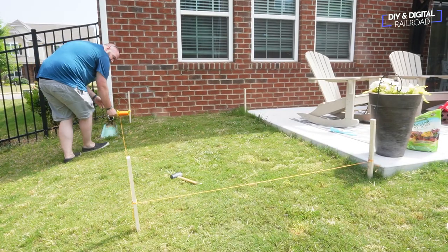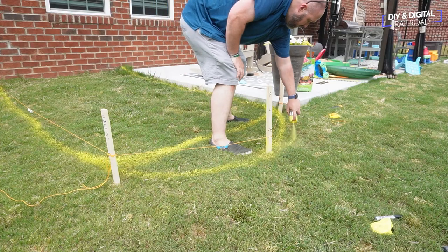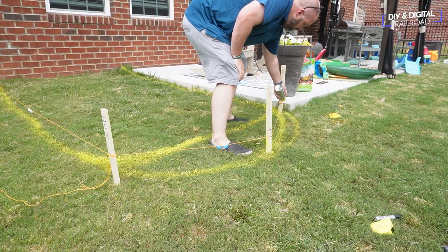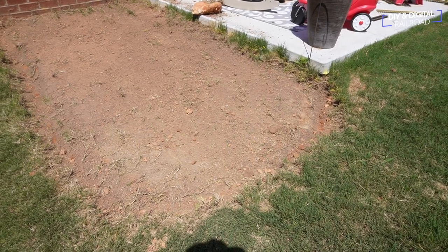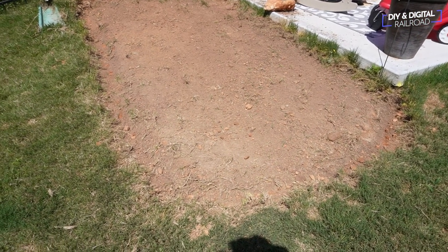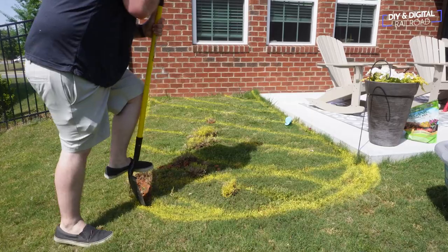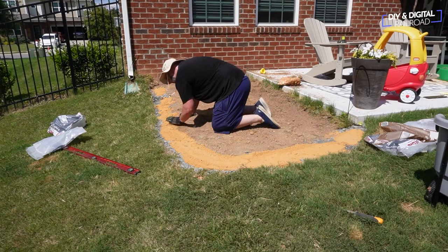I did have to build the bed from scratch. One of my wife's requirements was that I build a bed with a low retaining wall. I accomplished this by stacking stones. The ground only dropped about 3 inches from top to bottom, so it would not be compensating for much of an elevation change. I dug the trenches and lined those with stone for drainage and then paver sand for leveling.